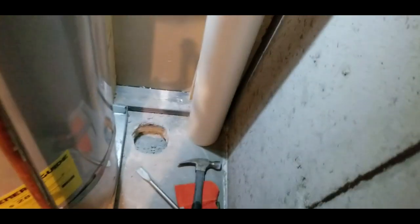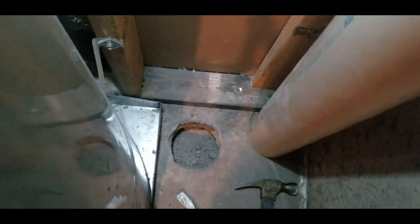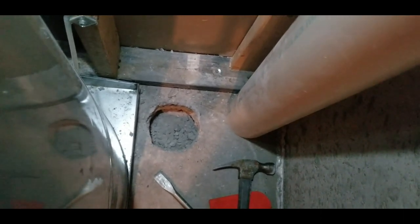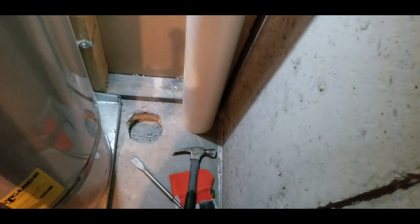I'm going to start digging a little bit here. It's an exhausting spot to work — it's a super tight place, and there's a gas line right here feeding my water heater, so I've got very little space to stand. This is another reason to check your house for radon before you finish the basement and install a radon reduction system beforehand. Even better, do it during the process of building your house — just put the pipe in. You don't even have to put the fan on right away. It would make your life so much easier, and it should honestly be part of the building code to have radon pipes installed.